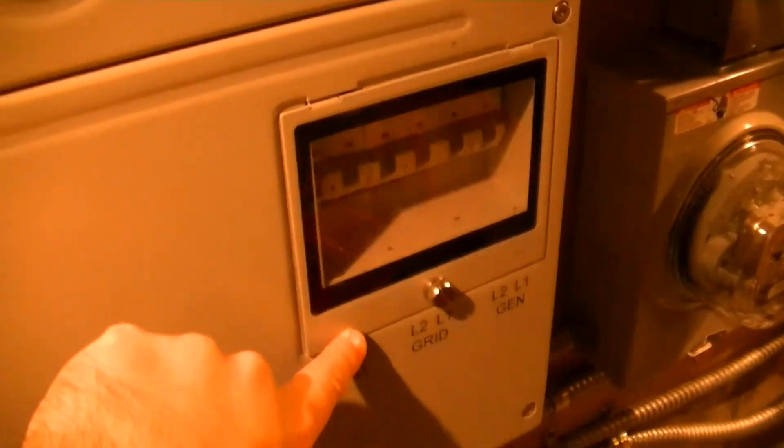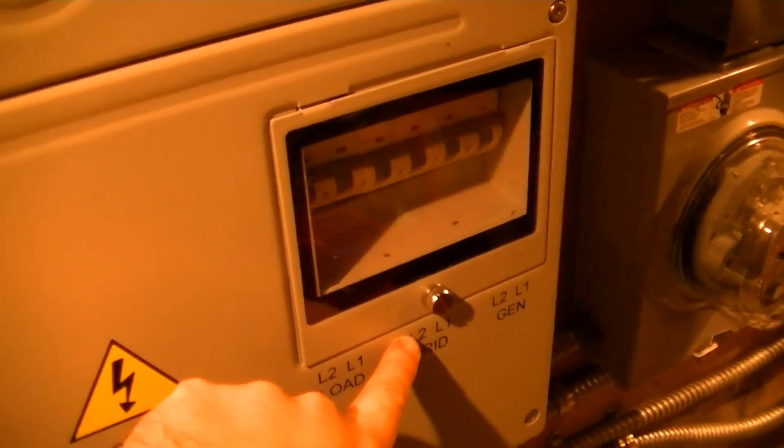And if the circuitry in the Solark for AC monitoring doesn't have the ability to monitor phase, as well as potential and frequency, then that is something to add to the next hardware revision, because I can see that being fairly important.